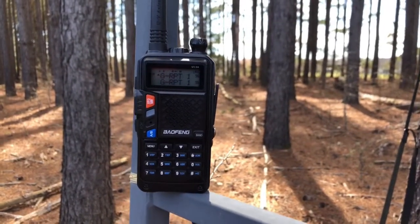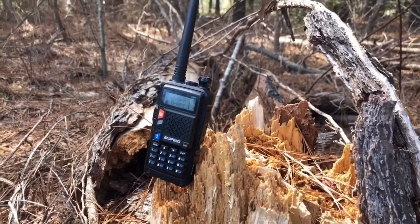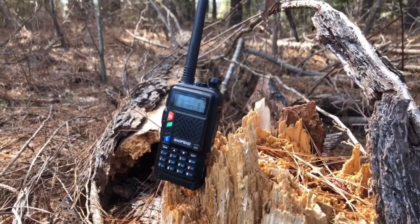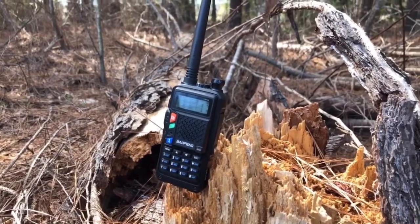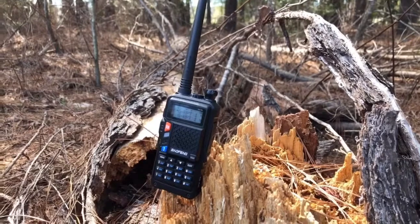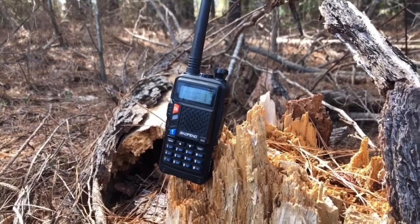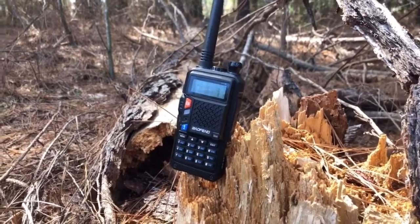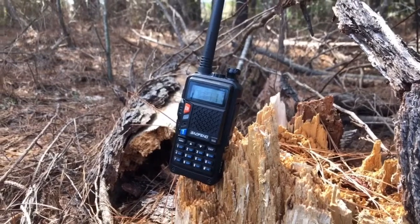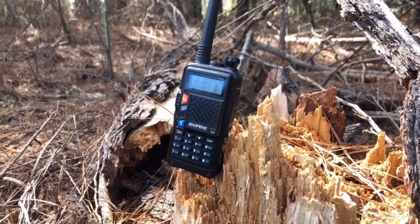So we're even further back. We're going to give it another test. Test one, test one, test one. The audio is not quite as good — I think we're getting some overload. Basically what we're finding is that due to the proximity of the two antennas, we're getting some front end overload. The idea is good, but ultimately you've got to get more separation between those antennas. It probably will be a better situation to actually just use the two ports on top of the box to hook up two external antennas that you can then separate with several meters of separation — up to five meters would be great.